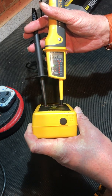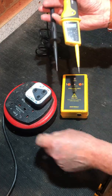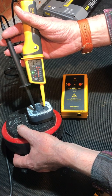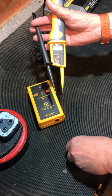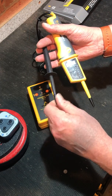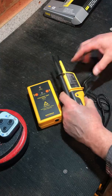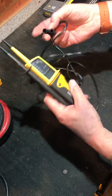That's quite a high-pitched tone at 479 volts with all the LEDs lit up to 400 volts. Pulling the tips off we get a slightly lower pitch at 236 volts, with only the LEDs illuminated up to 230. When doing your tests for indication prior to proving dead, you need to test at least as high as the voltage you're proving dead on. Ideally you'd want all LEDs illuminated, but that requires a proving unit putting out 700 volts, which means one of the bigger Martindale ones.